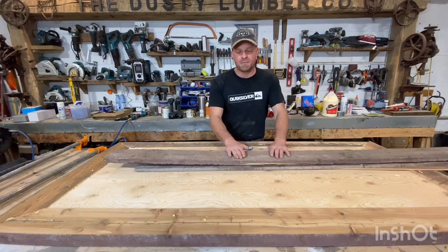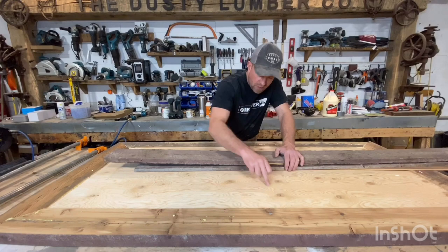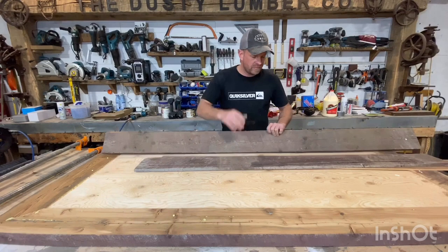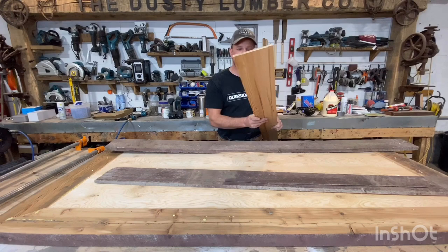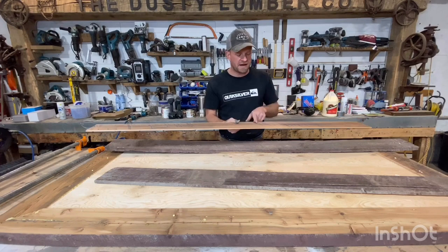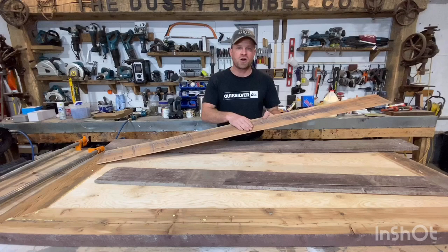While the glue dries, I'm going to put these interior pieces in. I've got a quarter-inch veneer now that's going on the inside. We start off with some one-by-sixes, run them through the re-saw to get them down to about three-eighths. After that, I straight-line them with the track saw, then run them through the table saw to get the other side so I've got nice parallel boards. Then I plane down the bottom side just a tiny bit, flip it over and skip-plane it just enough so the saw marks are still showing but I've got a real uniform board. From there, we cut and fit them in, glue them, and brad nail them.